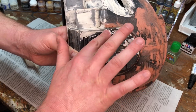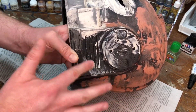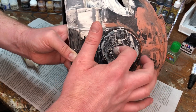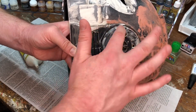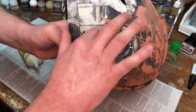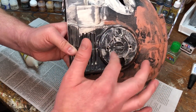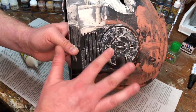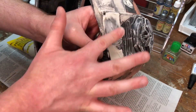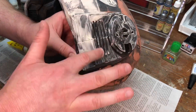What I don't like about the Bondo is it dries so fast, which is good and bad. If you're trying to do multiple coats quickly, it's nice — maybe ideal if you're working on your car trying to beat a rainstorm, which is what Bondo is actually designed for. But when I'm doing something like this, I'd rather have a little more time to work with it, not have it dry up fast and be a waste. Give me some time to actually work it into the little troughs between each layer of 3D printed filament, filling in all the different lines and detail. I really just want to clog up all those cracks and get the surface as smooth and uniform as I can. The nice thing is I don't have to be super clean about this because I'm just going to sand it down — I'm just trying to get coverage. I only care about putting too little on a surface, because I can always sand it down to the level I want.